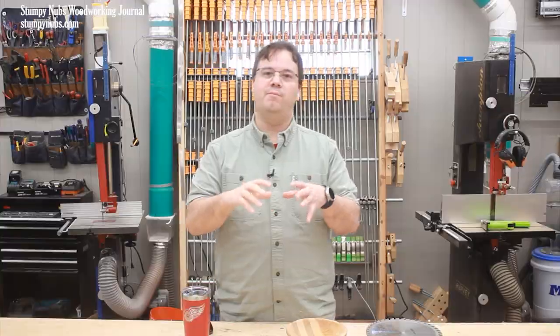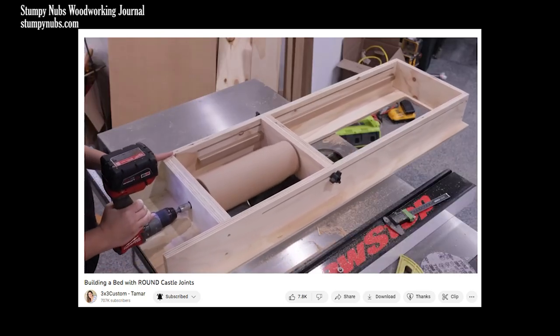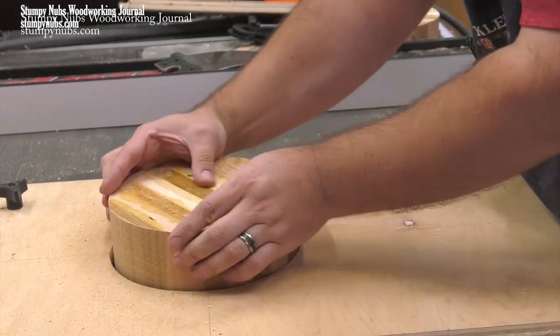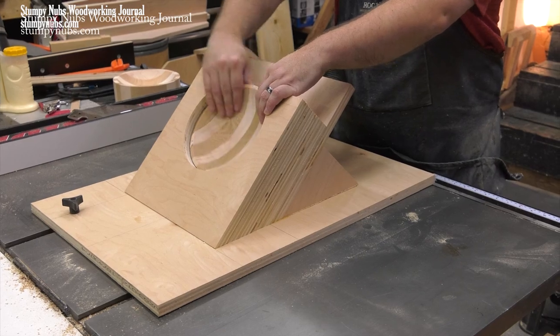Those are the things that, at least theoretically, could go wrong. And as much as I think they're unlikely to happen, we still have to ask the second question to determine whether a technique is reckless or reasonable: how can we protect ourselves should one of these things happen? The most obvious answer is to wear safety glasses in case something does fly back at you. And most importantly, be sure the jig itself keeps your hands away from the blade. Notice how her hands are positioned with lots of things between them and the blade. While the saw's blade guard had to be removed, the jig itself becomes the guard. If something goes wrong — if she's startled or something breaks — her hands are never over the blade or in its path. Likewise, there's an inch of hardwood between my hands and the blade, and in this case the jig itself makes it impossible to inadvertently get my hands too close.